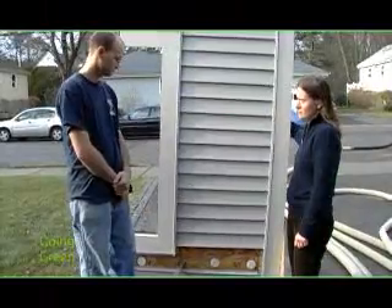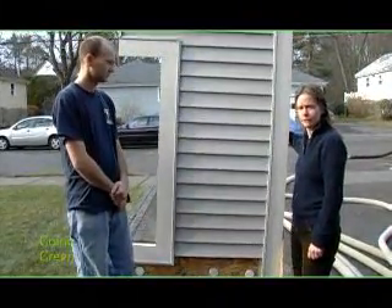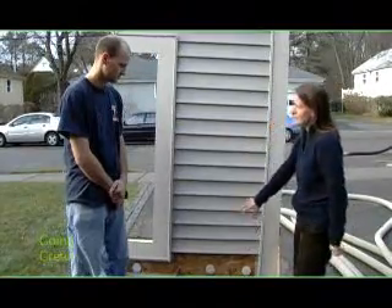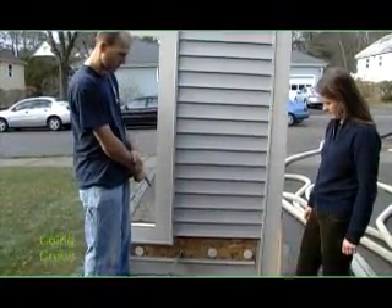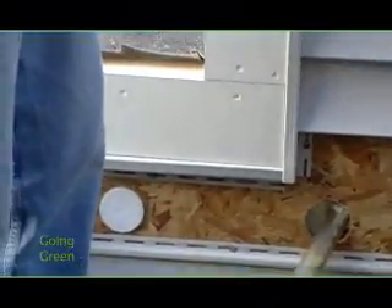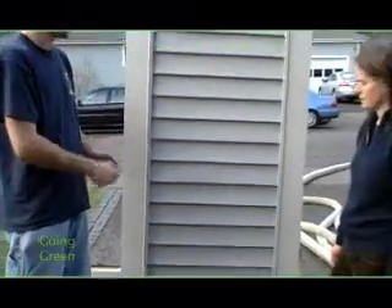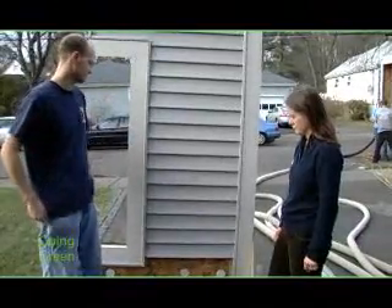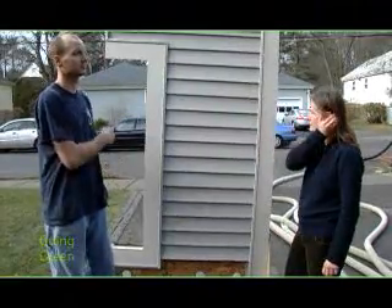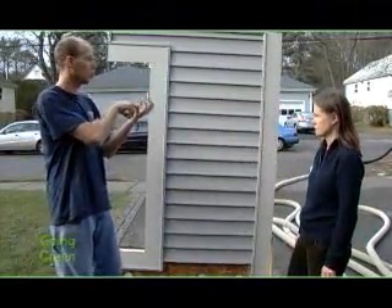So this is the outside of the house, just to show we're on the other side of the wall that we just saw — open with the cellulose and the fiberglass. To insulate a house from the outside, this is what you do: you take off the siding. Typically with a tube-fill installation, they would remove a band of siding around the middle level of your wall so they can feed the tube up and pull it down as they're blowing cellulose, and feed the tube down and pull it up. So it actually has fewer holes doing the tube-fill method than it would with an ordinary hose with a hole.